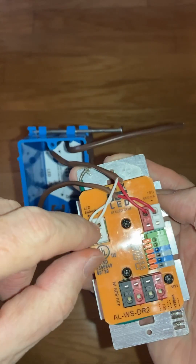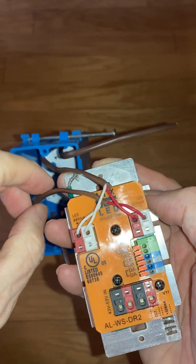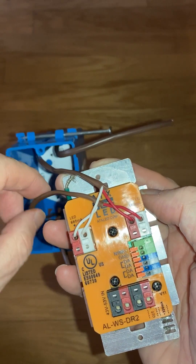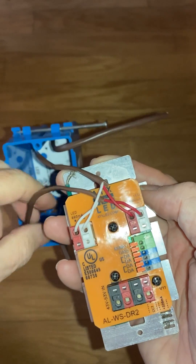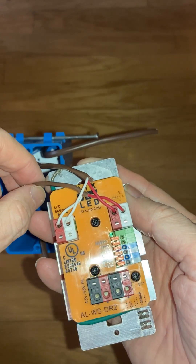Study this, because the first time it might appear to be sort of arbitrary. But the reason this is chosen is it allows the fixtures in the ceiling to be upgraded from fixed color to tunable white without having to change any of the wiring in the ceiling, which is super important.